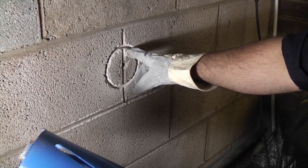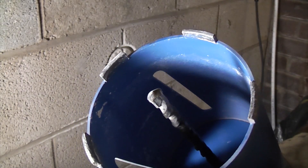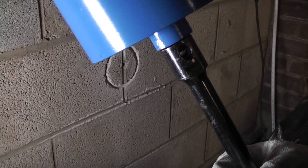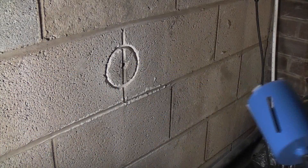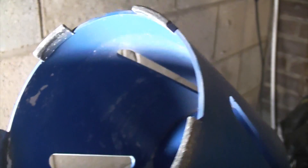Once you've got started drilling and you're about half an inch in, you can then stop because you need to remove the drill bit from the centre. If you keep that in it will keep jamming. If you look where the little hole is, you can actually put a drift in there and knock it through, and it will loosen the drill bit so you can just take it straight out. Another important point when using a core drill like this is to ensure the machine has a safety clutch.